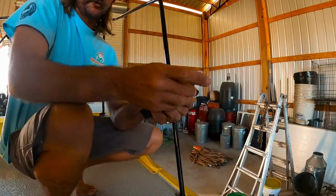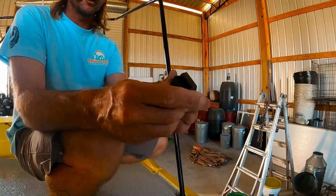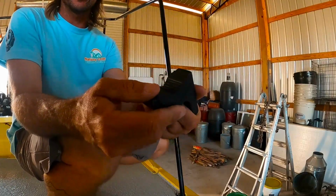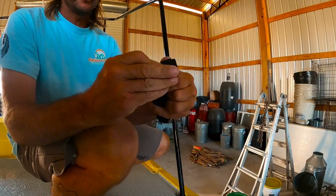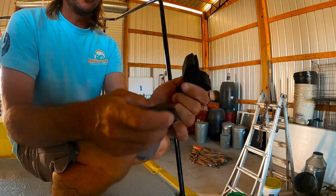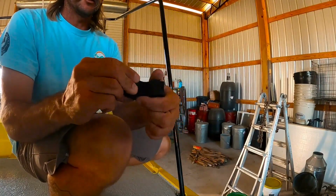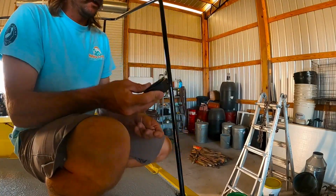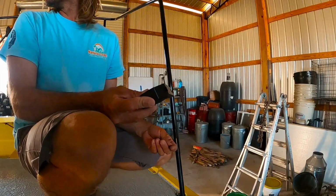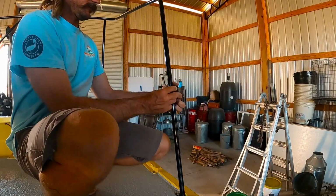They come with multiple inserts, rubber inserts, so you can change the size for whatever diameter bar you're gonna be connecting onto, and they just pop right in there. You kind of center them in where they go. Real easy. And then you'll have 2 Allen key screws with some lock washers, and you're gonna put it on the bar where you want it, put them together, run your bolts through, and that's it. So we're gonna copy the same thing that we have on the other side there, and it's gonna run like this.